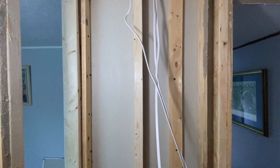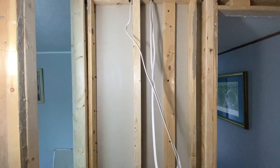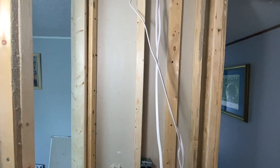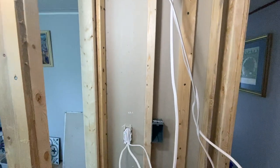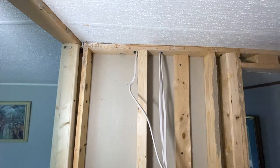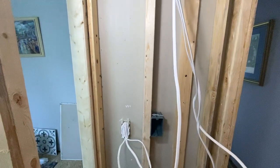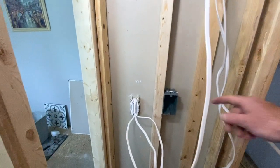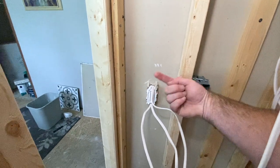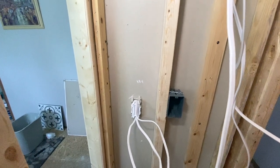This is the wall where we need to drill a hole. I've added this stud into the middle of the wall — it did not have one. That's actually a pretty bad design to have studs only on the outside edges of the walls; you'll have some racking problems, plus it's completely hollow and the drywall is unsupported across the middle. When I put the stud in, I put it in between where my wires come in on the top plate. That means the wires are going to have to pass back through at some point. We've only got one hot line coming in from the breaker box, and we're going to bring that into this switch box, but that hot also has to go over to the other switch to power the light in the bedroom. So we need a hole for the wires to go through.